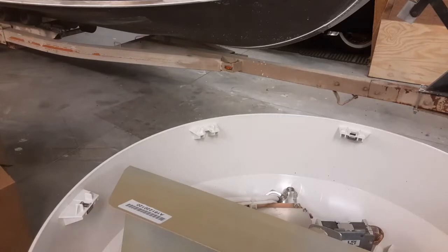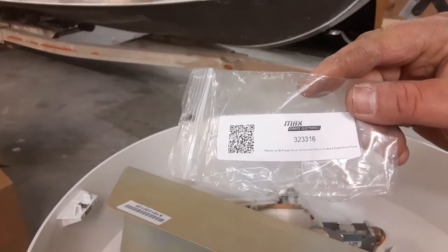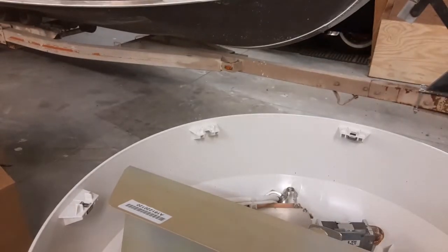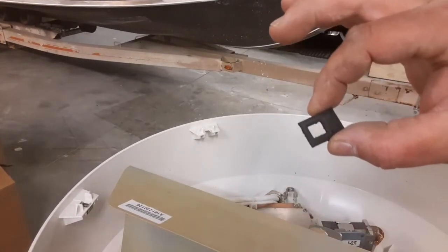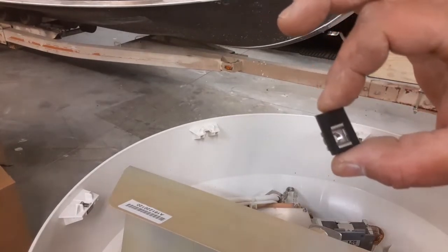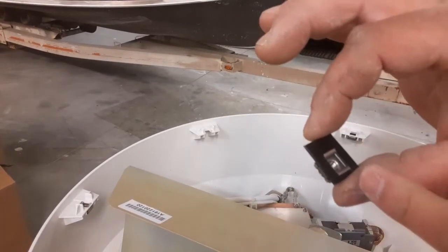In case you've got this problem, the Max Marine part number is right there — Max Marine Electronics 323-316. Again, check your usage on this and make sure it fits your radar. What they sell you is a little piece of plastic — I think it's done on a 3D printer. It's got a hole in the middle of it. That hole fits your fastener. You push it up from the bottom and it snaps through with the tangs.